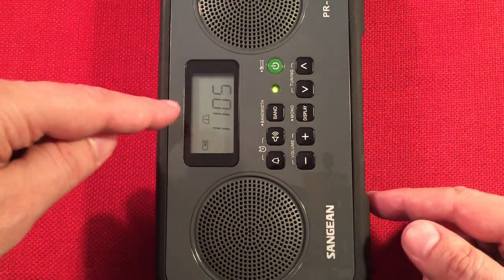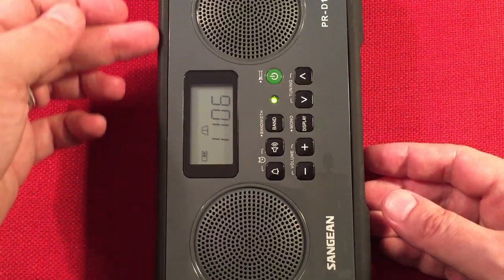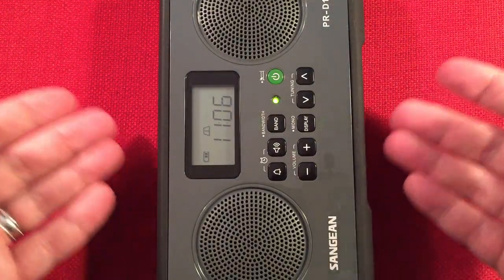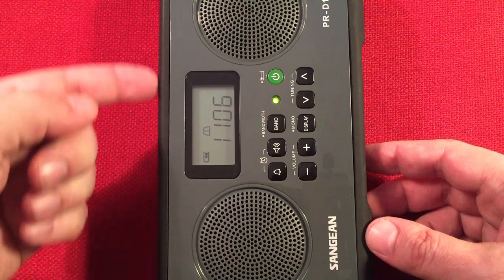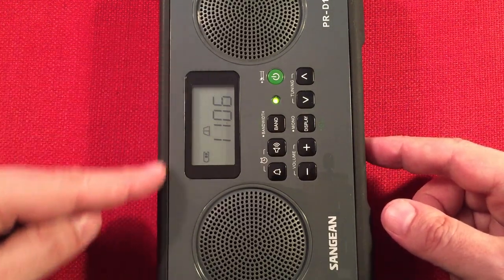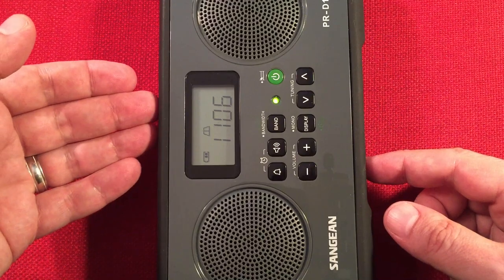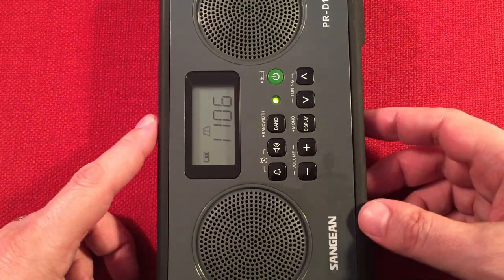That color changes with the white LCD LED. Also want to draw attention to detail here — there's a ferrite bar antenna that runs along this area. It's a horizontal ferrite antenna for the AM band, and then this one here is for the FM band. It's a coil of wire and it receives medium wave broadcast because the wavelength is very long and needs a special antenna. It's oriented horizontally, so when you have a station to the north or south you want to face the horizontal edge toward that direction. Right now it's picking up north and south stations.